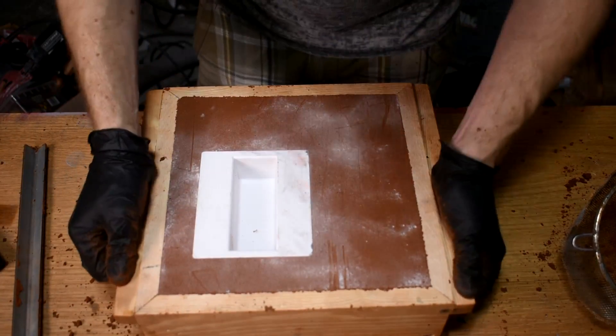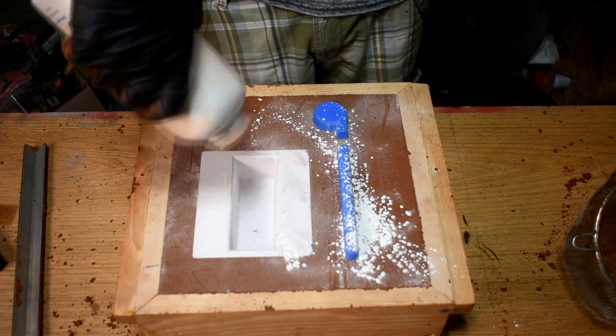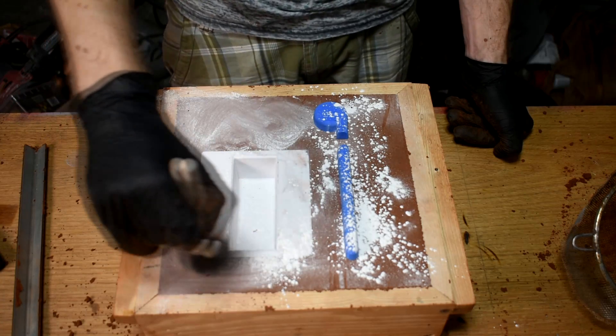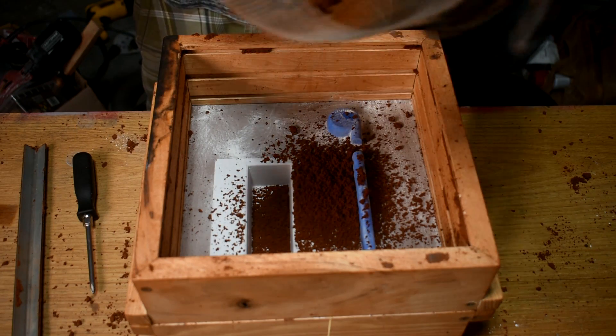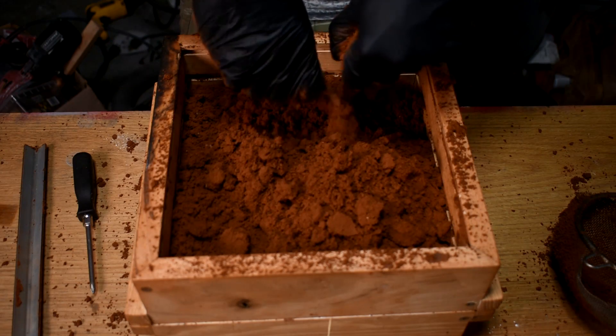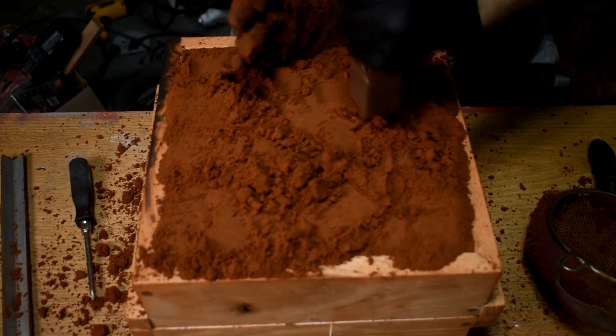The drag — the bottom flask — is where the fun begins. Some of you may notice the spin trap being disconnected from the runner. There's a reason for that. I 3D modeled and printed these runner forms, which are admittedly too large for this pattern. Honestly, so far I've only made two sizes of these: too big and too small. I grabbed the two big ones. The spin trap is disconnected because I've realized spin traps can cause some problems. One is caused by putting it too close to the pattern — the spin trap, being a big thick chunk of metal, can be the last thing to harden off, causing shrinkage. It can try to feed itself by sucking metal out of the part, and that's not good. So I figured disconnect it and choke the metal down going into it. Or just don't use one — I'm not sure the spin trap is ultra critical. A lot of the time I don't even use them. I do this other thing that serves the same purpose but doesn't have a big hard chunk. I might show that in a future video. Subscribe if you want to see that — probably 2029 at that point. But enough nerd stuff.